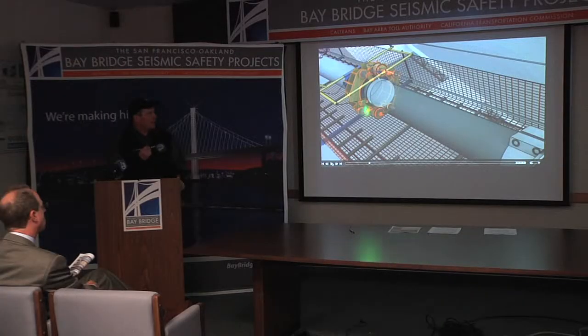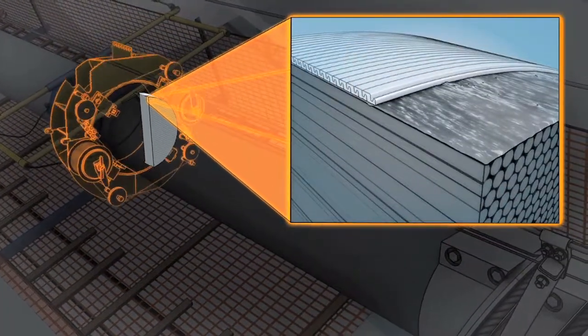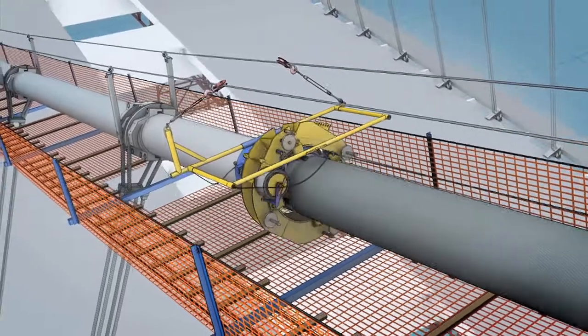This is what we're doing now, along with some painting, as we're trying to knock off that really long punch list so we can be ready for the opening on Labor Day 2013. We are wire wrapping the outside of the cable. How do we protect that main cable from corrosion? We start off with the individual wires all galvanized. Then on top of that, we use a zinc-based paste that we slather onto the main cable so that we've got that tight connection — it almost forms like a gasket, it's so thick on the outside of the wire. That's two levels. The next level is this S wire wrap — it actually interlocks, wrapping radially around the outside of the cable so that you have a tight lock. There's the zinc-based paste, and then a three-coat paint process on the outside of that should get us over a century's worth of life out of this main cable.